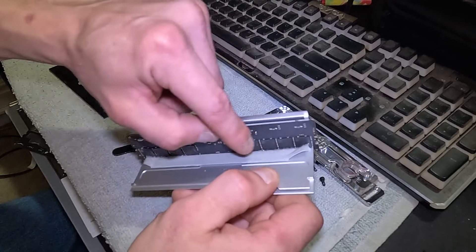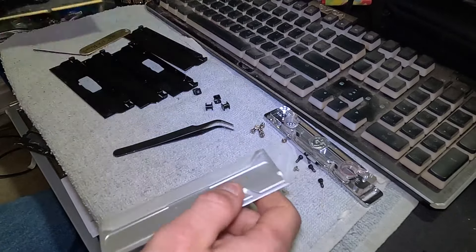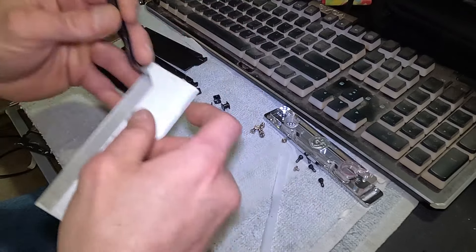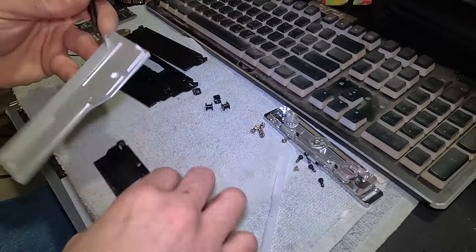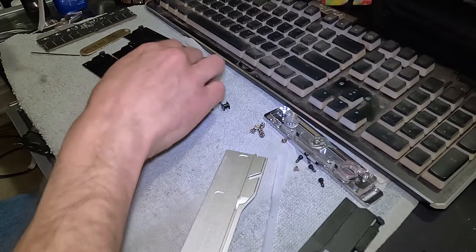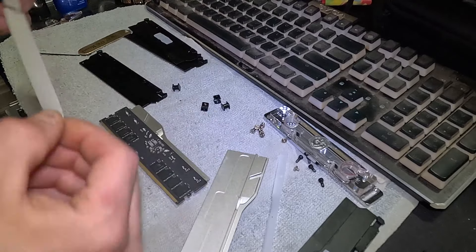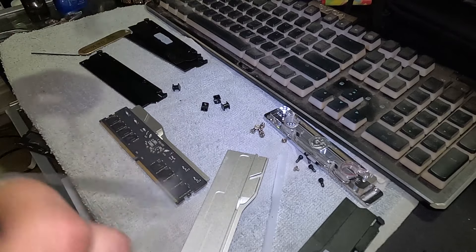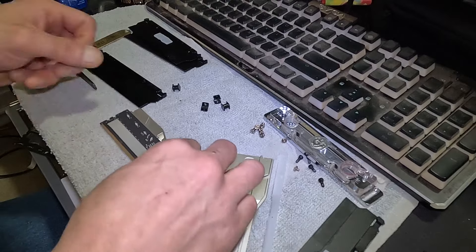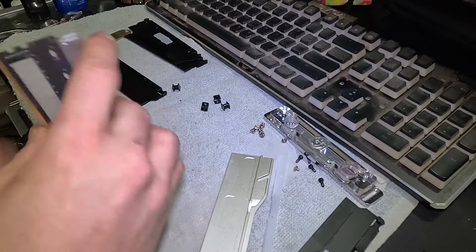I'm being careful because this double-sided tape I'm going to reuse on the water block heat sinks. Now while it's still warm I'm going to be very gentle because this stuff is extremely sticky — I'm just going to peel it right off. Just like that. To keep everything lined up, see how sticky it is — doesn't even want to come off the tweezers — I'm going to transfer it right over to the RAM stick. Bang, the transfer is done. That's that, now I just need to get the back side off.